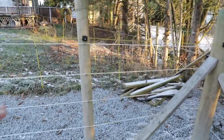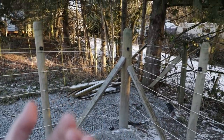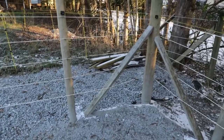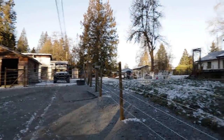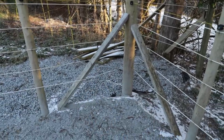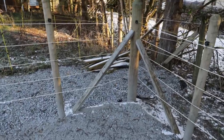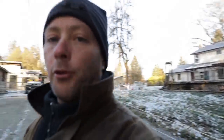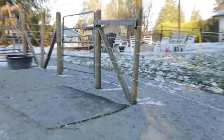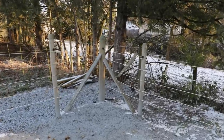For the corners, you're taking the line and bringing it on the outside, so the corner post is going to want to draw in. For extra bracing, it's recommended that you have your corner post and your gate posts with another supporting post four feet off. Then you'll have a 45-degree supporting two-by-four for the corners and the gates. I also put a cross post on top because it helps strengthen things a little bit more.